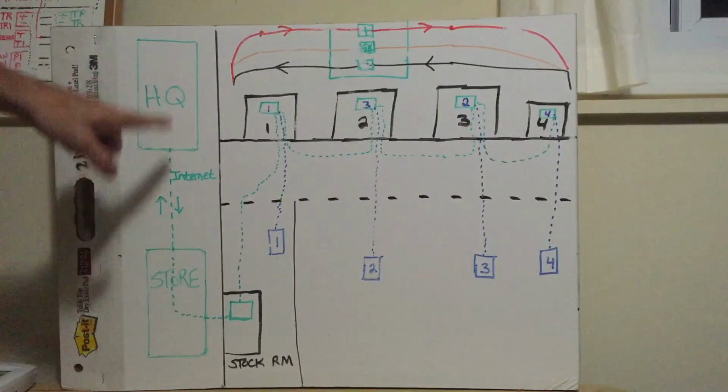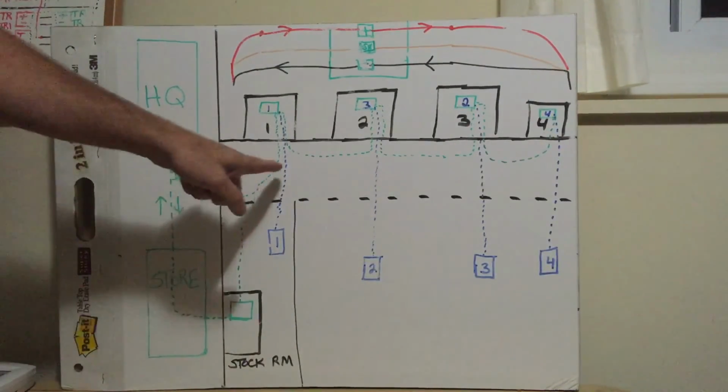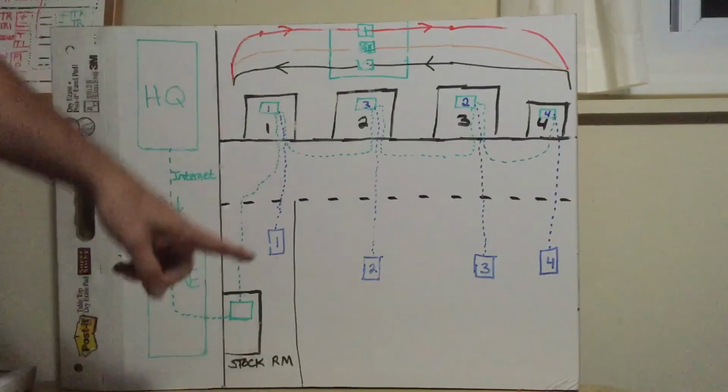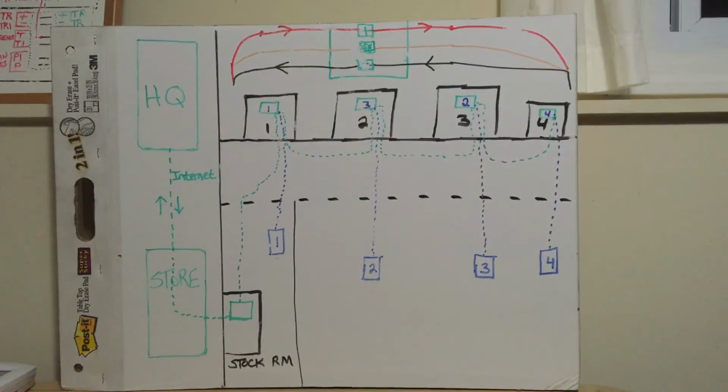either the problem is in the internet or in the router, or sometimes if you have a cut or broken cable here, it'll cause enough interference where this will go into a reset, and there's so much noise and interference on the line they can't communicate with it. Be like if you cut your modem cable at home and shorted it to ground or something.